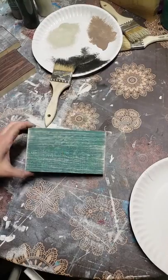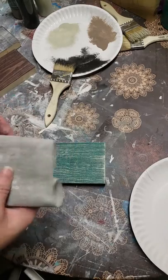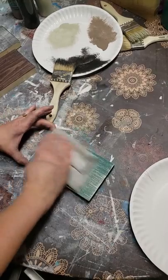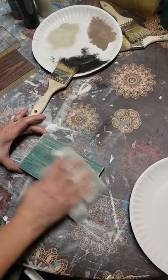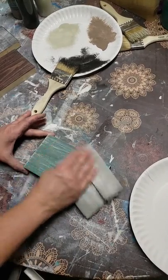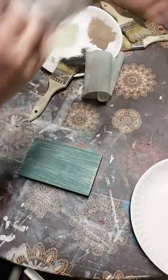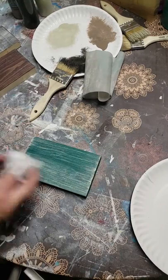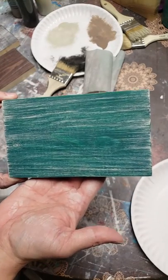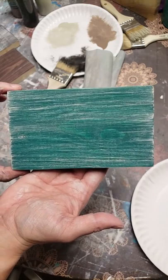If you've got this and the lines are just too harsh and you want it a little softer, you can take some 220 grit sandpaper and very, very lightly — barely putting any pressure — go over it. I always use baby wipes to clean up my dust. You can knock some of the harshness back down and soften it back up, bringing a little bit more of the base color back out by doing that.